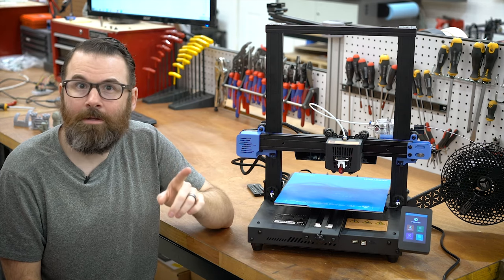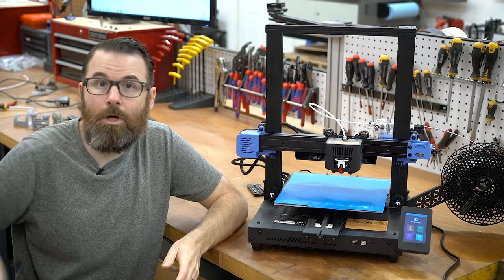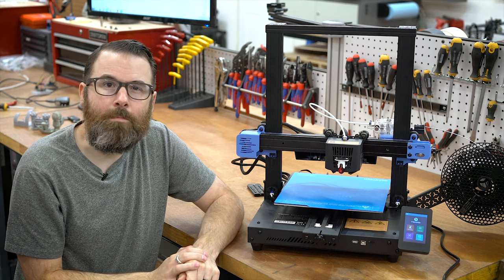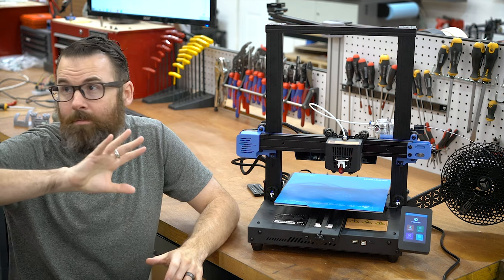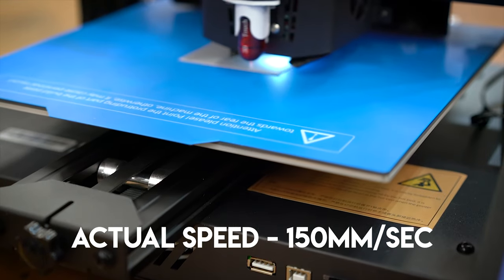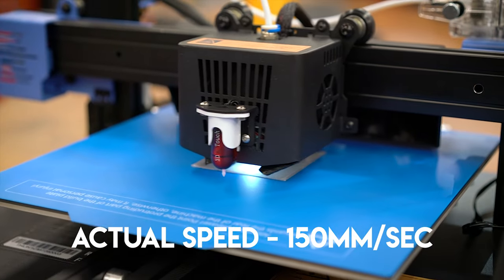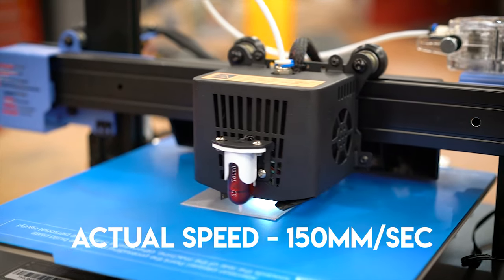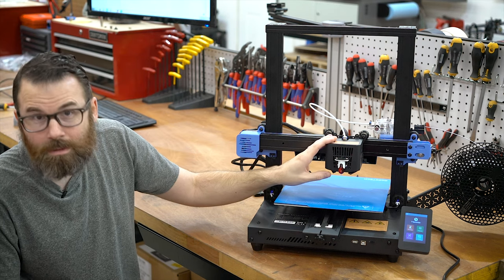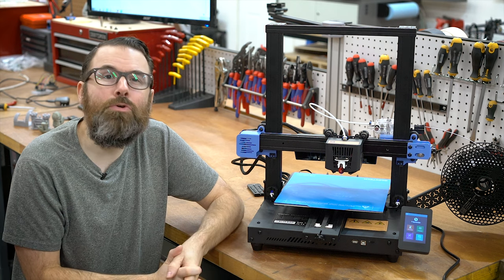I love that it doesn't have spring tensioners you have to manually level — it's a rigid bed. The build surface is one of the first I haven't had to use a glue stick on; PLA sticks perfectly. You can theoretically print at 250 to 300 millimeters per second — I say 'can' in quotes because quality suffers. But if you're looking for a secondary printer that can just bang out parts quickly for prototyping without going the Voron route at $1,000–$1,500, this is great. Standard printers do around 50 mm/s, this can easily do 100+ and still produce usable prototype parts.